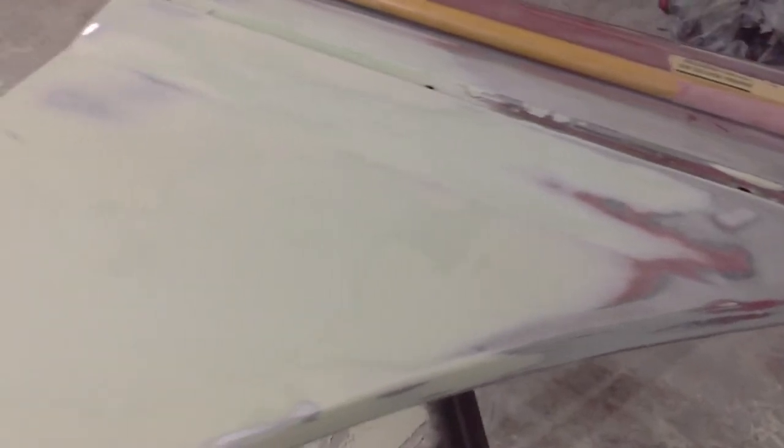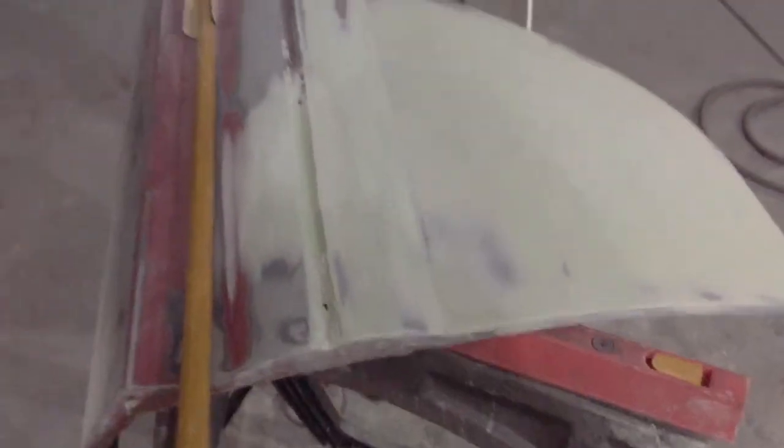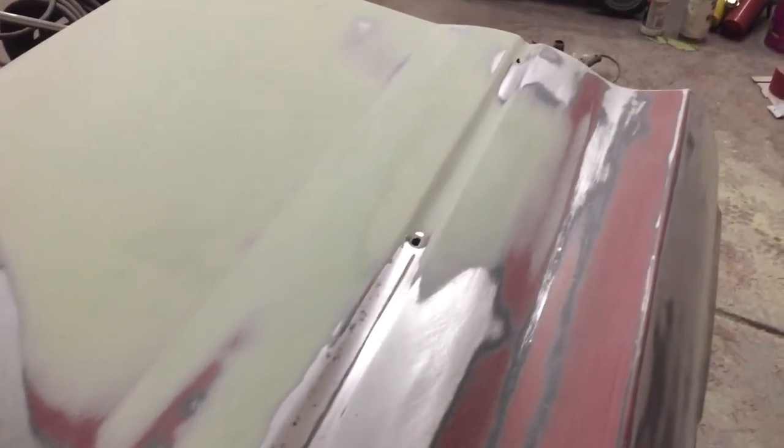I just keep sanding until I don't go too far and end up with high spots where the bare metal is. So overall this has a fairly thin coat. In this low valley where the forklift had bumped it — just low enough that I did put filler down the middle of it. And in order to sand that, I commandeered the handle off of my broom — it just ends up being the perfect fit in that groove. It's just a half round. And there we go.